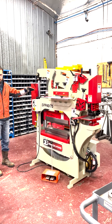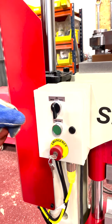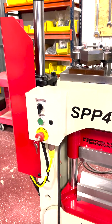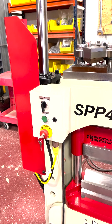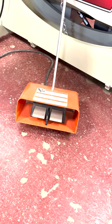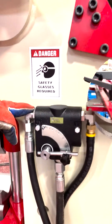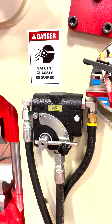This machine has the production control — the electronic version. It's a cycle control where you set the upper and lower limits, and you can cycle either to the press side or the punch side of the machine. It will do one cycle when you press the pedal and return, or it can be in jog mode. For this demo we'll leave it in jog mode, where you run it up and down with the foot pedals — there are two, left and right, one up and one down. There's also a speed control so you can adjust the speed.